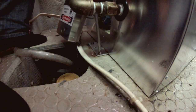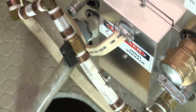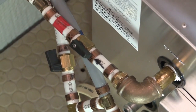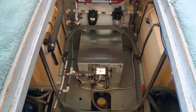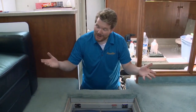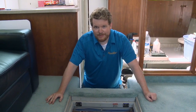With the plumbing and electrical all hooked up, you can now secure the unit back to the boat — here that means a few screws at the front. Test it first by turning the water back on and looking for leaks. If there are none, turn the power back on. There'll be some air in the pipes at first, so just run through and you're set. We have no leaks, the power's back on, and we have hot water again.